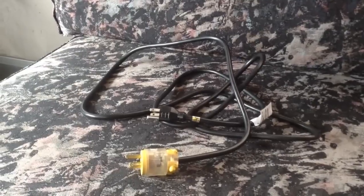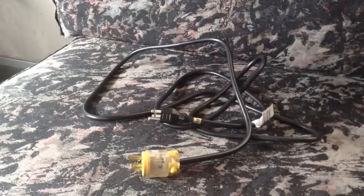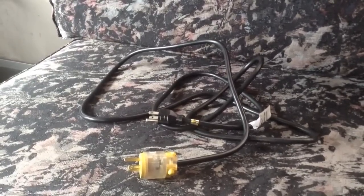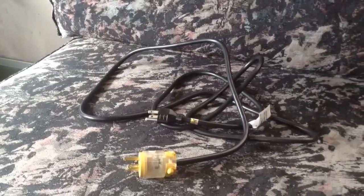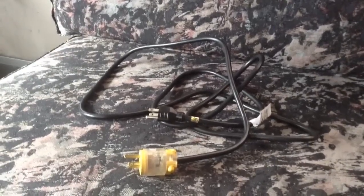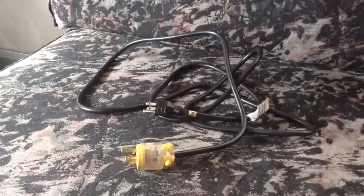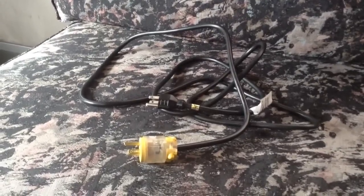The reason is because you're powering a line which would normally not be powered. Power line workers will, as part of their safety protocols, check those lines for power before reconnecting them. If they find that a line is hot, they're probably going to assume that somebody did a wrongful generator hookup and just not fix it. If they don't discover it, you could be harming these people, and we don't want to do that.